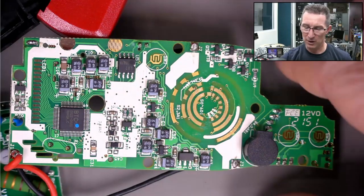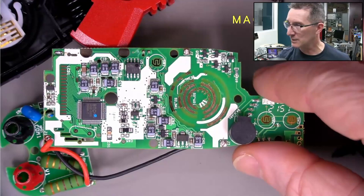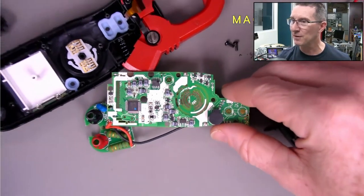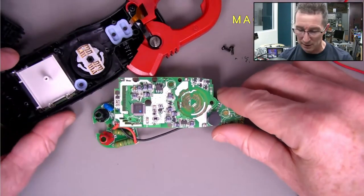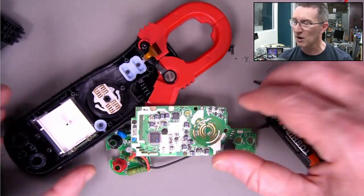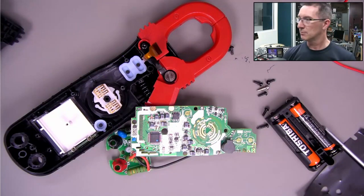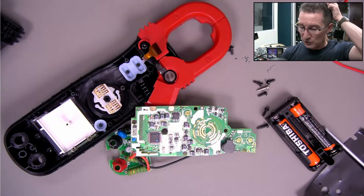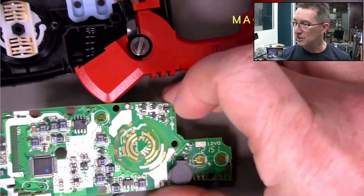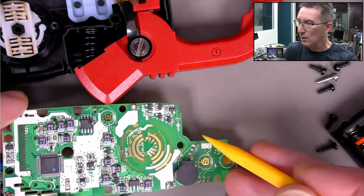I'll leave this apart so I can take some high-res photos for my product listings. I think that's pretty good. Who thinks I should carry that on the store? Give me a thumbs up or thumbs down. Circuit boards like this are routed - you can see the mouse bites there. This was panelized - attached to a panel - and everything is routed with a drill bit that goes down and routes out any shape you want.